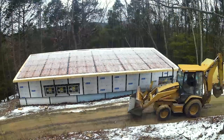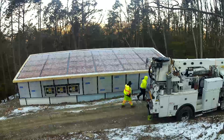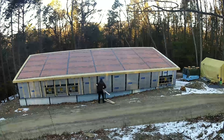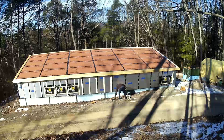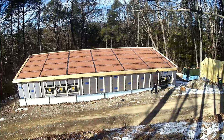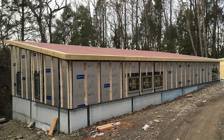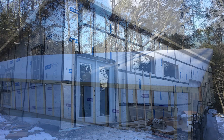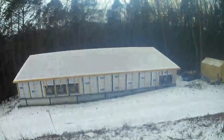The electrician gave me a hand because he saw me struggling alone. We ended up getting more snow than we've ever gotten — three feet on this roof that just has zip panels taped and liquid zipped. The electric company and internet company came and I got both hooked up — I was stoked. What a great product Huber Zip is; it lasted through all the snow and kept the inside of the new building dry. I fastened furring strips through the foam into the sheathing and framing and got through all that through the winter.